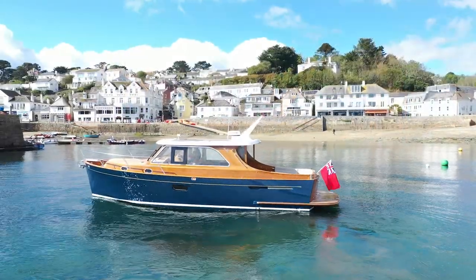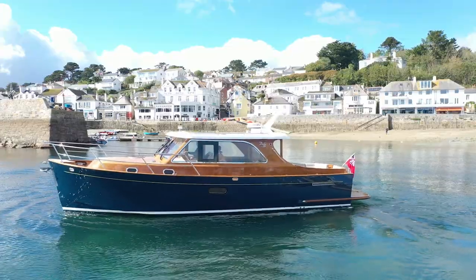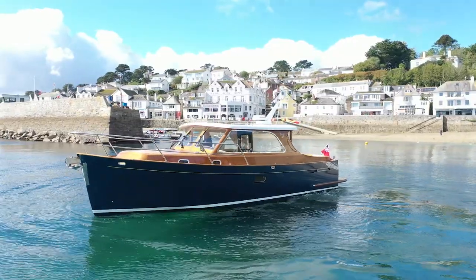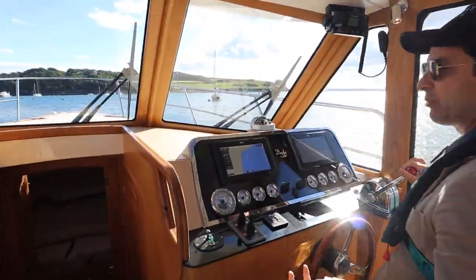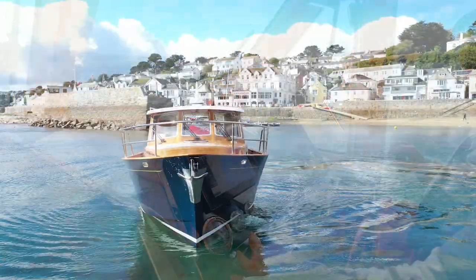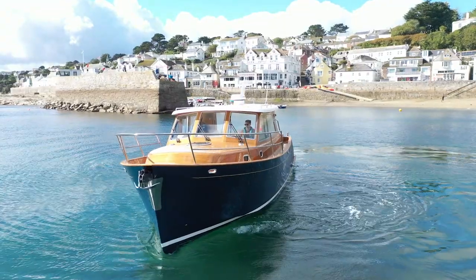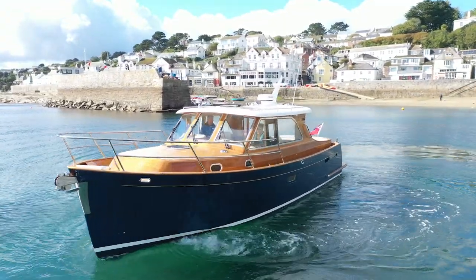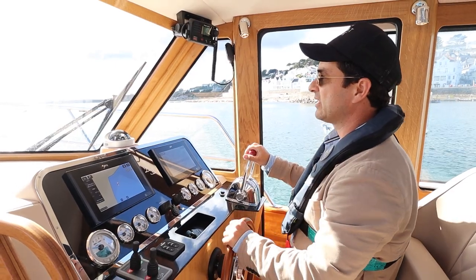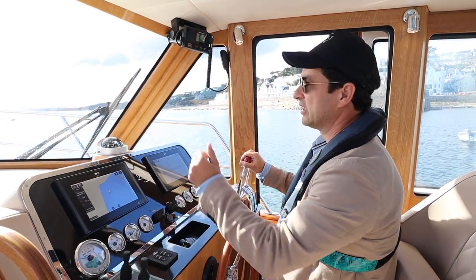With the prop location and the amount of torque available, I can just increase my power and the boat's going to go, and then I can decrease that power. If I'm not comfortable doing it with the throttles, you have another option — the thrusters. Plenty of power, no issues there. You can equip yourself with bow and stern thrusters if you see the need, or just put a bow thruster on it, because with the twin engines and the bow thruster, she's quite capable.